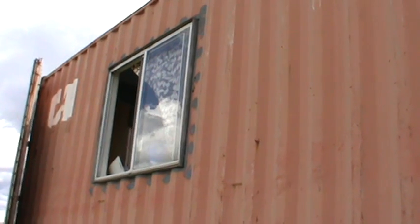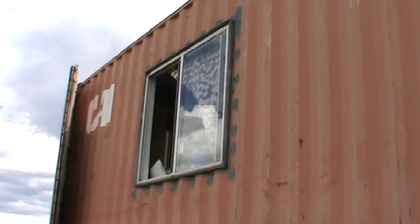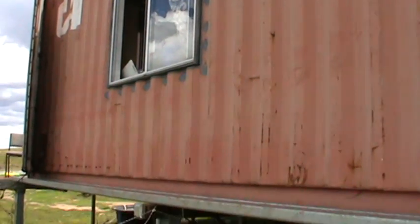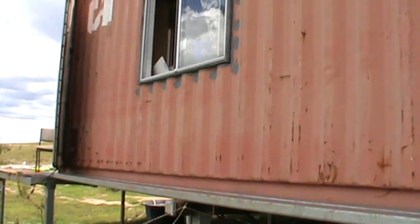So in effect, when you're putting windows or doors in this sort of installation, it does to some extent affect the structural integrity of the walls. Well, I guess it does to a certain extent. But the angle at the top is a bit like a galvanised lintel. That angle is 6mm thick. Putting the angle back in there like that, there's no flex in that wall now since it's gone back together like that. It seemed to work alright.